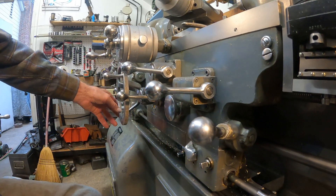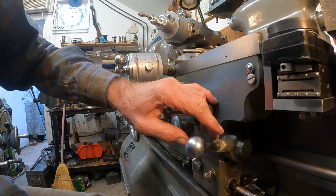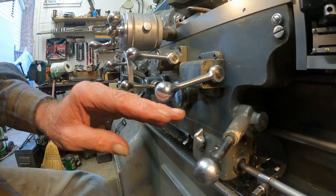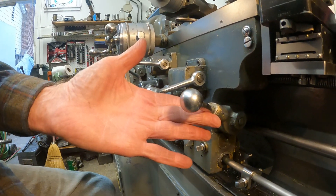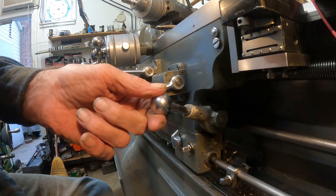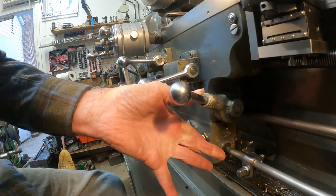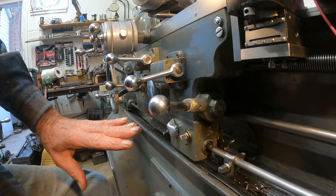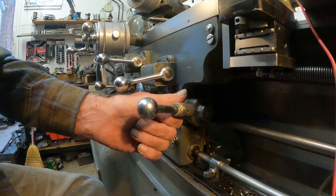Here's the real problem: when you're done cutting threads and you back the carriage off, this from its own weight can fall into forward. So you've got to make sure that the ELSR forks return that lever to neutral lock. Up here is reverse; that's neutral lock. To move it to reverse you have to pull this out — that's its safety. So if it's coming up and it doesn't go all the way to lock where that handle snaps in, when you back the carriage away it can fall into forward, you might not notice that, and you can get injured. You've got to make sure when using this device that it returns the switch to lock.